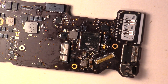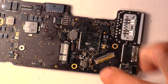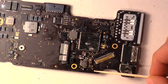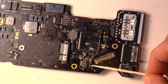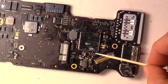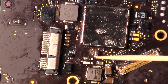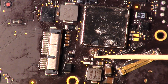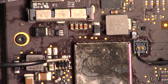In my last video you guys saw me change out this cable. Another thing I did — which probably didn't need to be done — I replaced these two capacitors right here. They actually didn't need to be replaced, but that is part of the backlight setup. Test the coil as well — that was fine, I did not replace that. The second thing you want to look at besides the cable and the connector is this chip right here. It has a little 'P' on it — that is a backlight fuse. I watched a lot of different videos; some people said it doesn't blow that often, but that could be your issue. I would check that next.